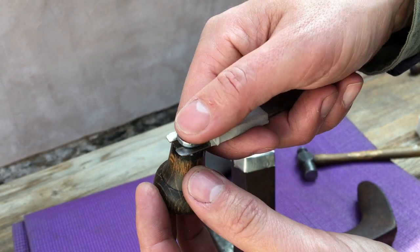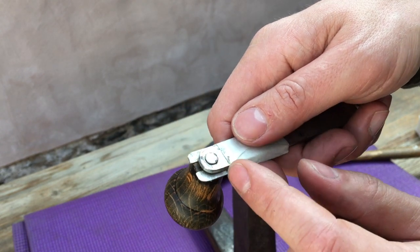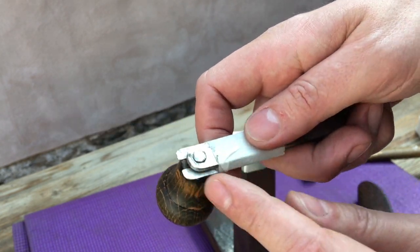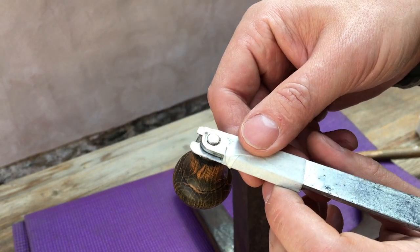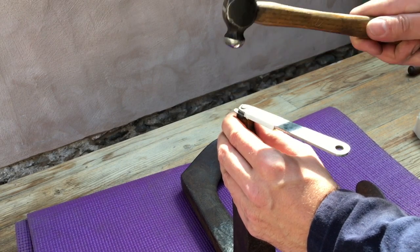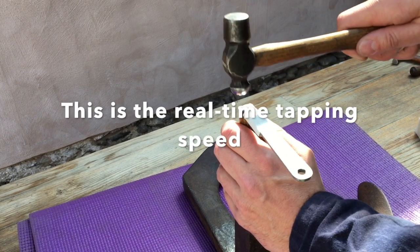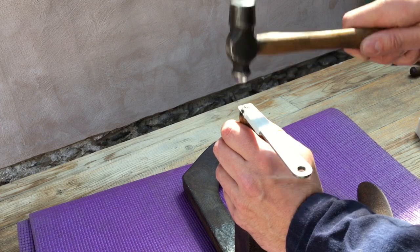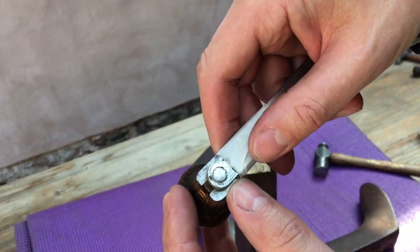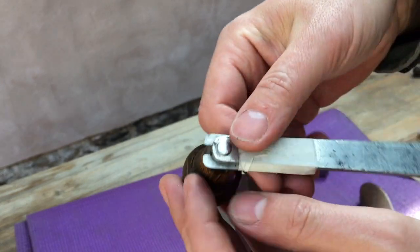As you can see this is getting a bit more rounded off. One thing I would say is don't stop too soon, because if you take this spacer out and find it's not quite tight enough, you'll have the devil's own job getting it back in. So make sure you've gone far enough before you remove the spacer. Keep checking, keep having a look at it, and as I said the main thing is don't stop too soon. I think that's nearly done.